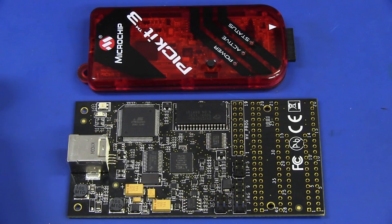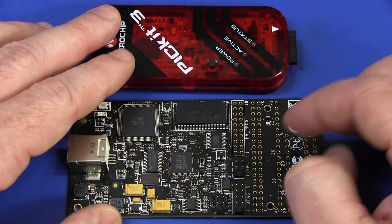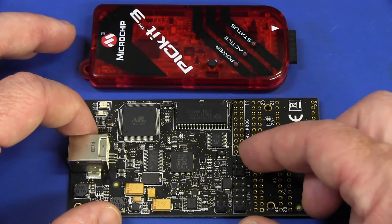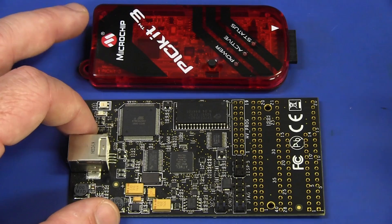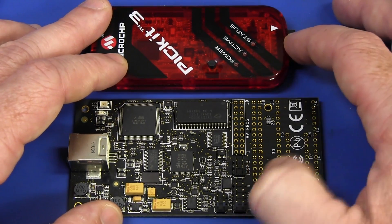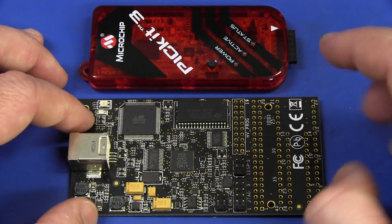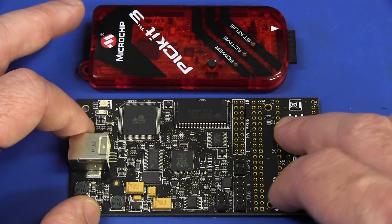This is actually rather clever and possible because of not-too-dissimilar programming interfaces between the two. If you know the PICkit 3 and the ICSP interface — 6-pin single inline header — the AVR ISP interface is a 6-pin dual inline header. Nothing you can't fix with an adapter cable of course. There are protocol and other differences between the two, and of course a lot of the PICs require that high voltage programming source — that VPP source — which the AVR Dragon can do the high voltage programming part on. But I believe you have to wait for the new version of the AVR Dragon to get that capability.